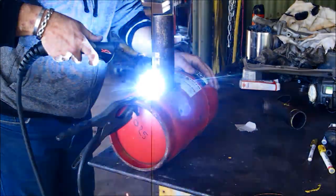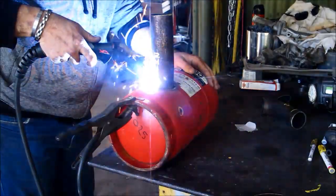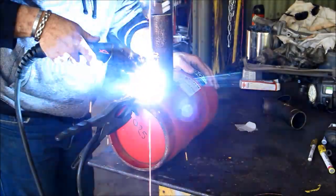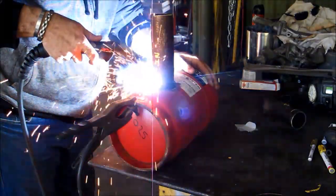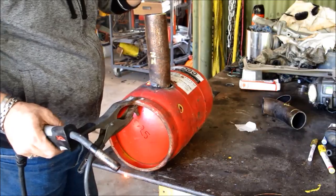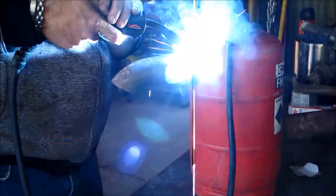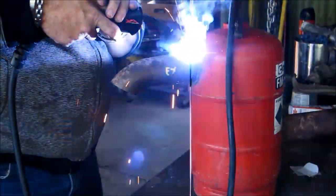Here you can see I'm welding in the bottom inlet. Try to do a good job on these and don't get any pinholes, particularly on the bottom, because if you do you can find the oil leaks out and you'll get some smoking and maybe a little bit of dribbling out below the burner. I found that as long as the holes aren't too big, any little pinholes will fill themselves up with residue from the oil and they tend to be self-sealing anyway.